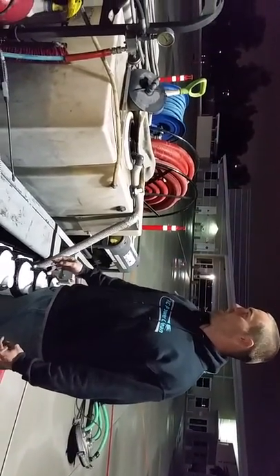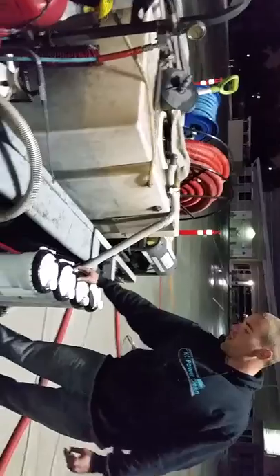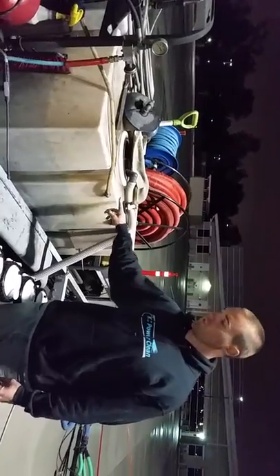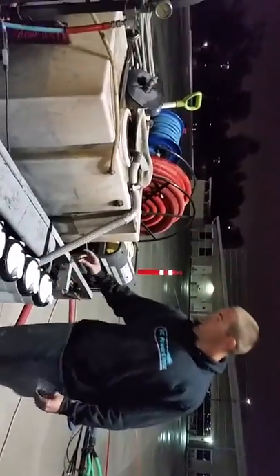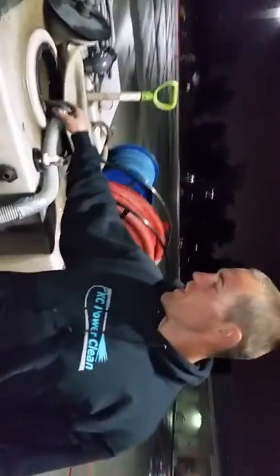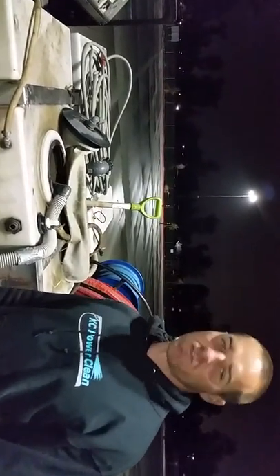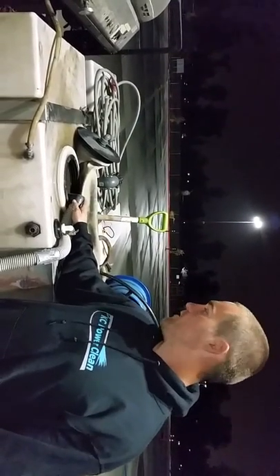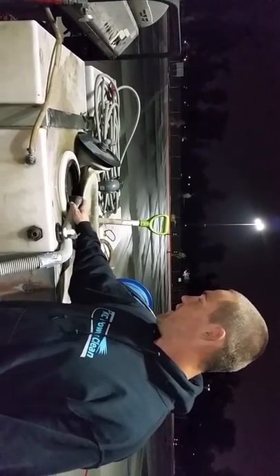But tonight, as you can see, we're on a big concrete pad and water is not easy to get to. So what we do is we are recycling the wash water straight back into our wash tank and reusing it right as we wash — we have a closed loop system. We disconnected and hooked up to this guy. What this does is it polishes the water down to 20 microns through these four filters here and then comes back out. You can look in the tank and the water is not drinkable, but it's definitely clean enough to wash with. We're able to reuse this wash water for as long as we want tonight and keep it from going into any storm drains.